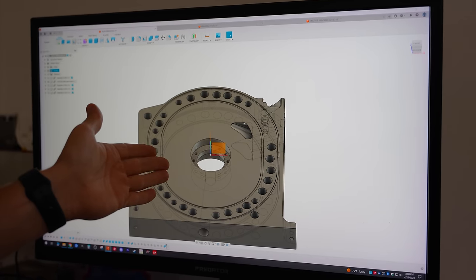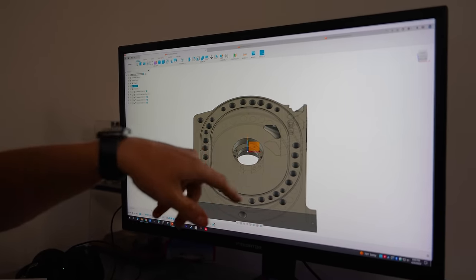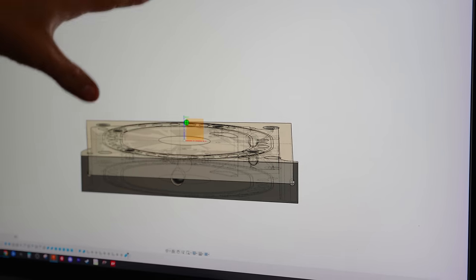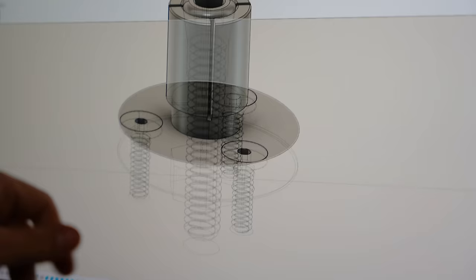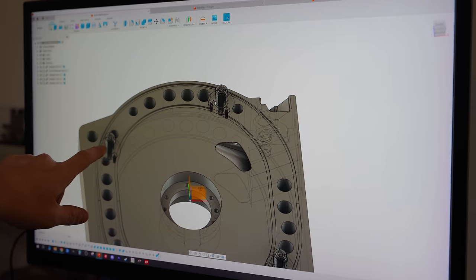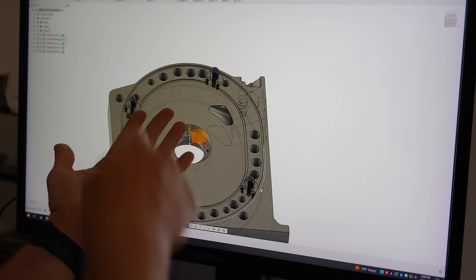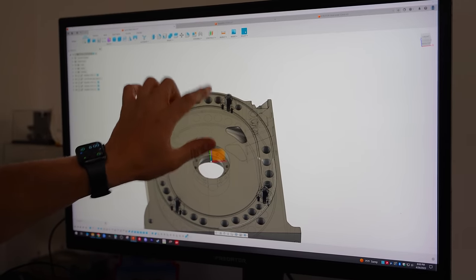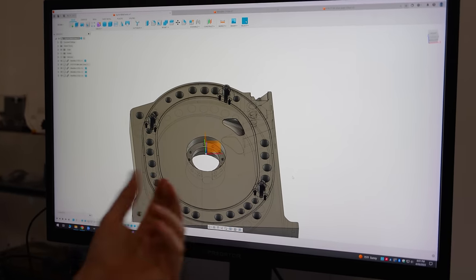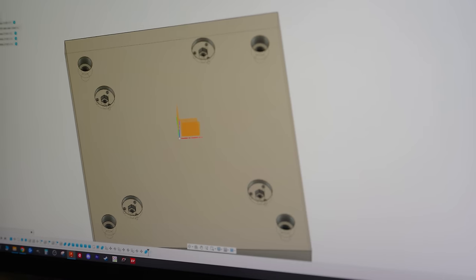We want to be able to bolt it to the table in its raw form to be able to cut all of this. It's not that it'll be sitting inside of there as much as it'll be sitting on top. We have a little thing called Mighty Bites. I was able to take our rotary engine, and I picked these coolant holes that will allow me to hold this. We're going to have it upside down, cut the reverse, these four holes, cut them, flatten that piece, slap it onto the piece that's in the machine right now, and then tighten all four of these, and that piece is now being held from within.